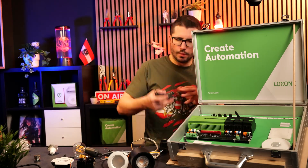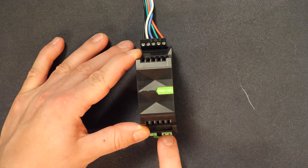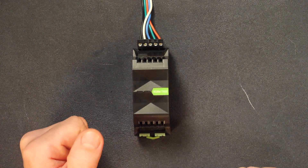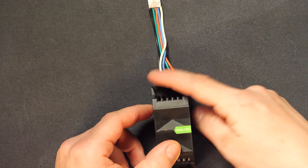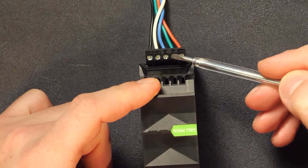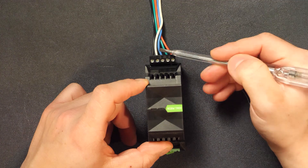Let's have a look at how to wire these different types of lamps to the dimmer. The Tree version of the dimmer is powered with 24 volt and also has the Tree connection. I've put it out of the cabinet to show you, and we'll program it in the config in a second. Here I've connected a color LED strip to it — RGBW — so we need all the outputs for the color LED. You can see it in the datasheet: it goes RGBW, and you have the 24-volt plus here, so these four channels are the minus.